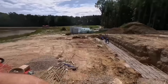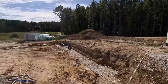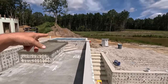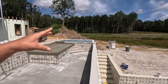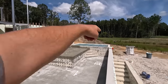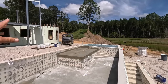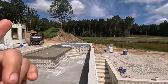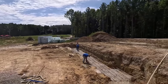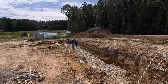So this is 13 yards, so that's over a truck. That's about 8. So these two together will be the first two trucks. Third truck pulls up, we start on that. I know those two together should be about 6 yards. And then picking up, we got that big footing there. So by the time I get to the third truck, I'll know what we have left. When I see it pull up, I should already be able to figure out and call in my plus. So all right, enough yapping, because Josh needs my help. He sees me over here just yapping away.